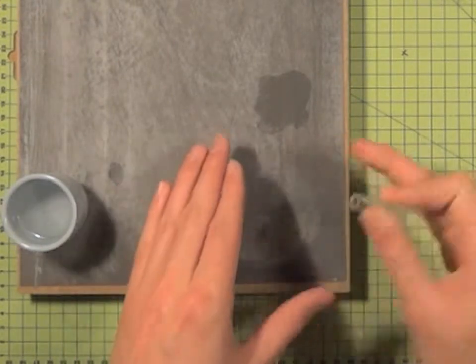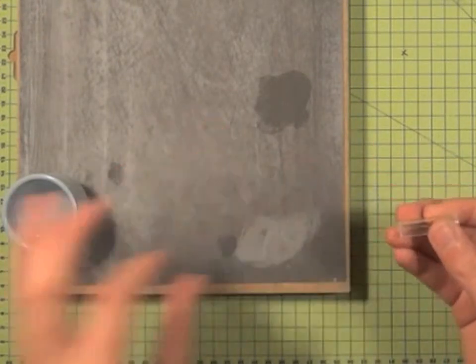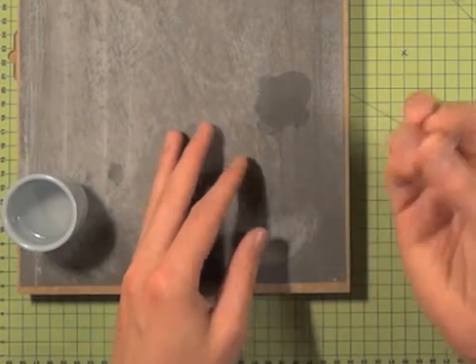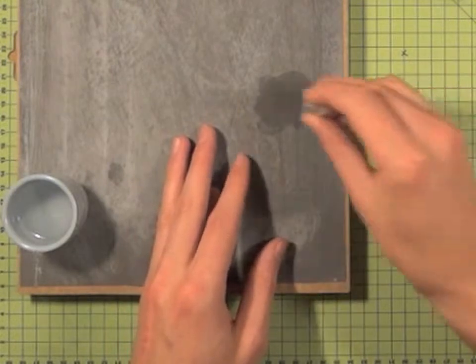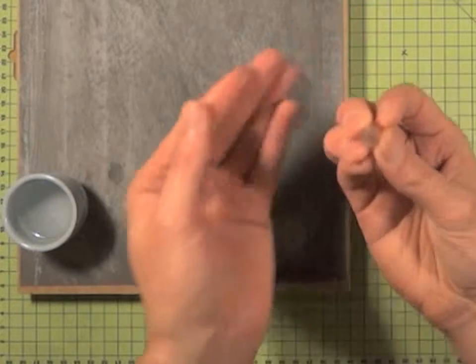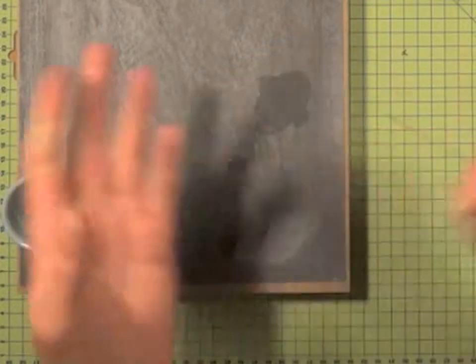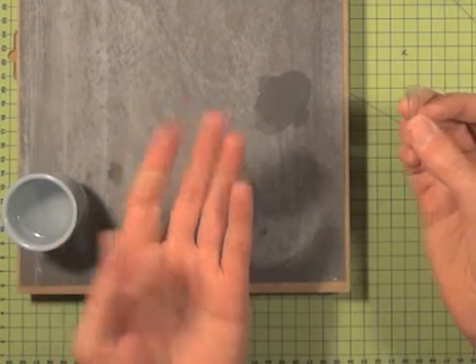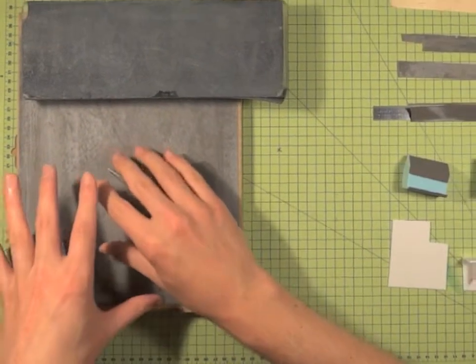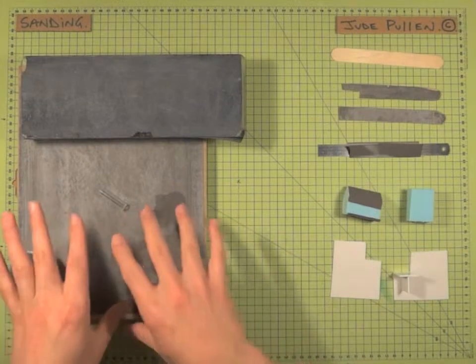Now again, I'd recommend using things like wet and dry paper, where you just put a bit of water on the sandpaper, for working with plastics, as it really gives a much nicer finish. So you'd work it like that, then lightly dry it off to see how well it's coming along, and keep repeating it till you get the desired effect. So that's really putting the sandpaper static and working the piece onto it.